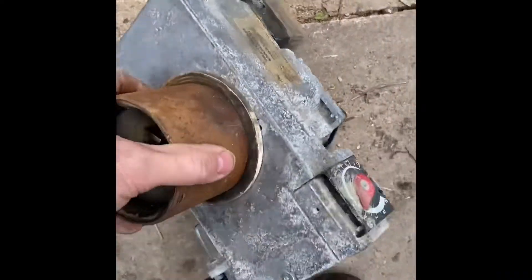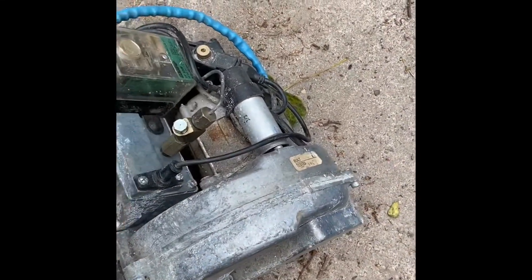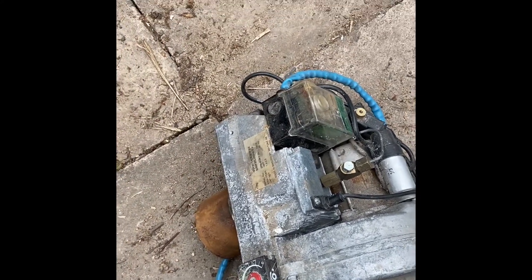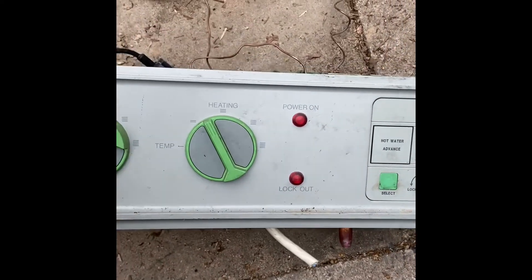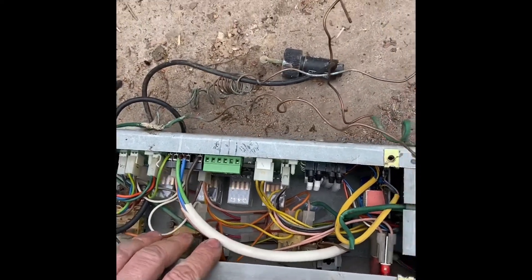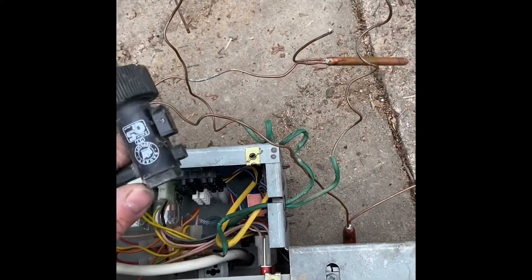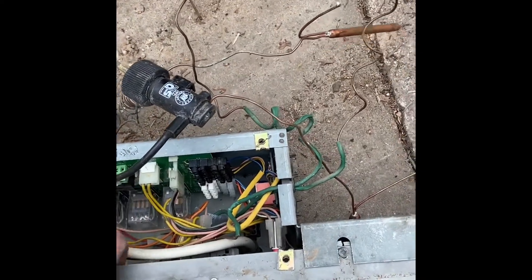We're not going to cover much of the burner side because this burner is essentially separate from the boiler for today's purposes — it does its own thing. So if that lockout light's coming on, the chances are it's either something to do with the burner or the fuel, nothing to do with what I'm about to show you. This older model here shows your thermostats that tell the pump and everything else what to do, along with relays, switches, and the flow switch — all your thermostats that control temperature and limit stats.